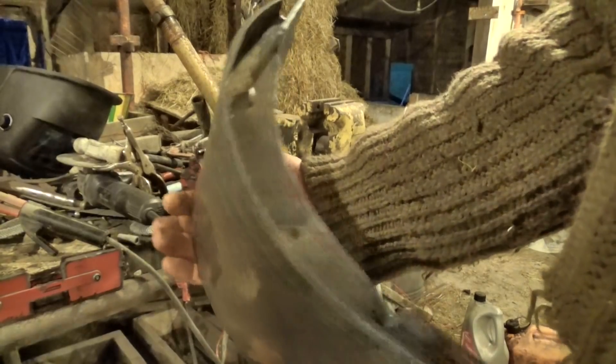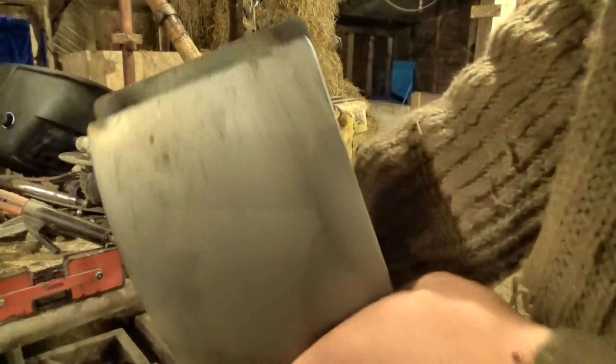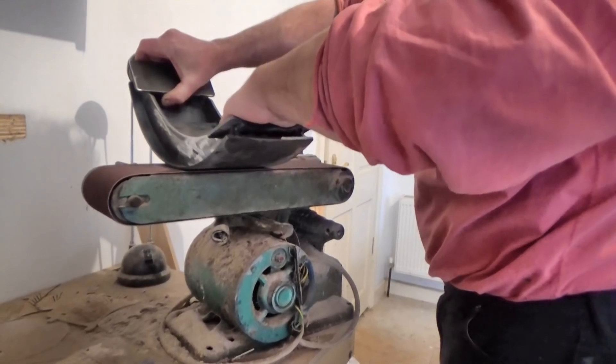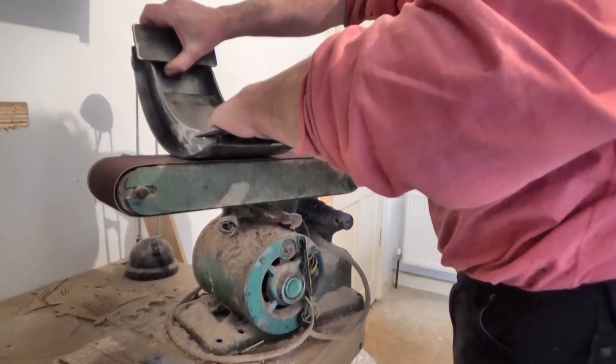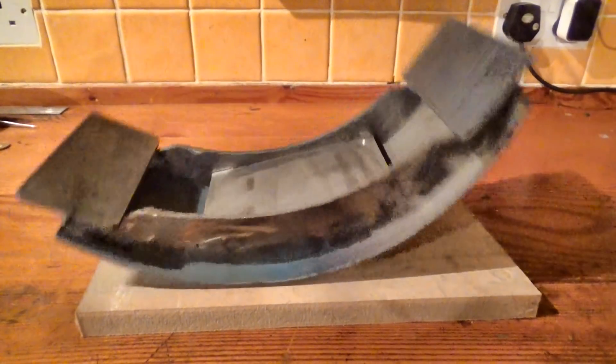But I was pleased with the rest of it. There's just a tack of weld in the four corners because welding would distort the surface of the roller too. Eventually I sanded out the concavity on my belt sander, but it took a long time because it was a millimetre out in the middle. It's still not perfect but good enough to try out the principle. It probably doesn't need to be so tightly curved anyway — it rocks satisfyingly well, and it weighs about five kilos so the momentum keeps it going forward.